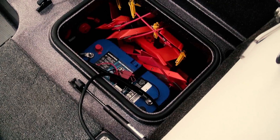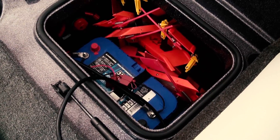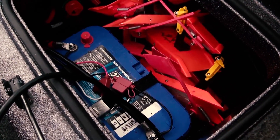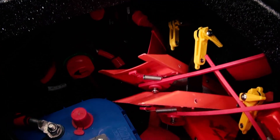First is simply having an extra battery. While that may be overkill for some people, I run a 31-series dual-purpose battery. I actually have two on a battery switch, and that's going to allow me to run my multiple units and everything else in the boat without any issues. You don't want to kill your main motor and not be able to get home because you're running your electronics too much.